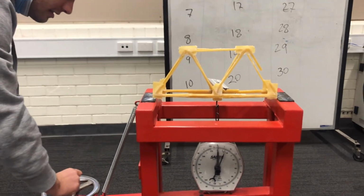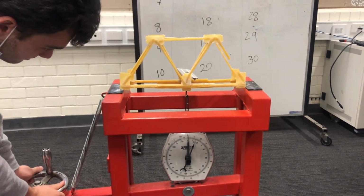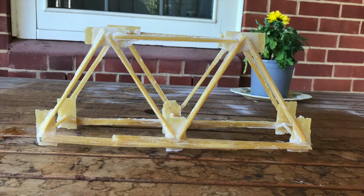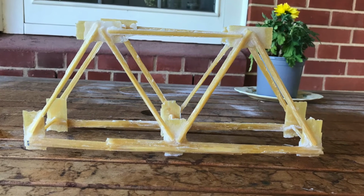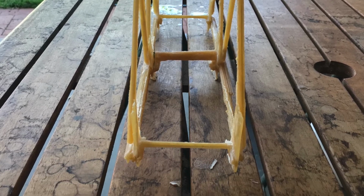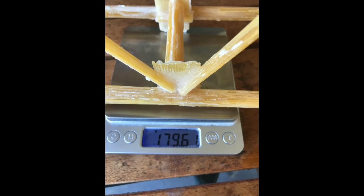The gang nail plates proved to be very advantageous as they gave a large surface area for the members and glue to stick to. In the future, a larger emphasis would be placed on focusing on every detail in order to avoid small mistakes and time wasting. All group members learned a lot about how loads are distributed and how they interact with different members and joints, including the failure points and limits of each material.